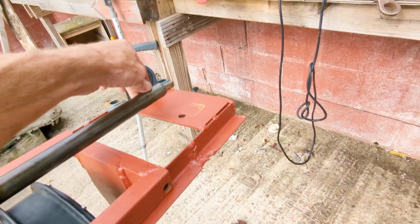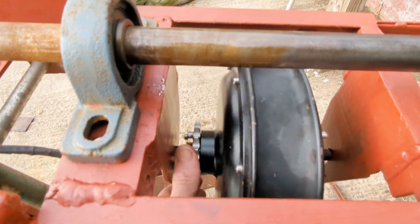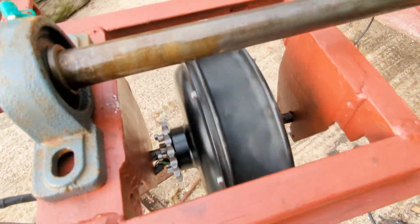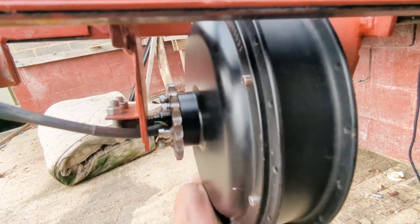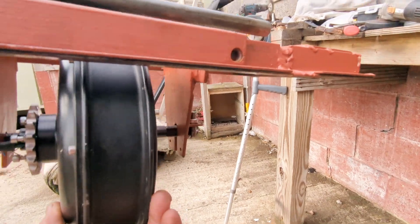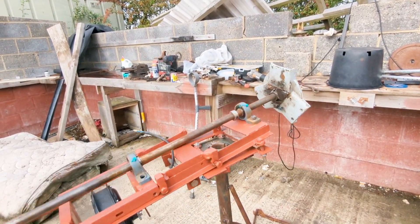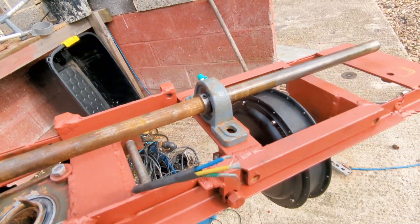Also, the way I've done it with the drive shaft equalizes the stresses very well. The blades are on here but they're all kept in place by the bearings — they can't move. I made sure that was nice and straight and then the power is just transferred straight down. What people don't really realize is that it's quite hard to turn this motor. The benefit of an axial flux turbine over this is that it has a lower start-up speed because there's none of this resistance. But my design has the advantage that the motor is suspended front and back, which offers maximum stability. I haven't seen another design that allows a motor to run at high RPM incredibly stably because it's mounted on both sides — it would normally be in an electric bike. It's a 3-kilowatt 72-volt motor, though I'm not saying it's going to make that.